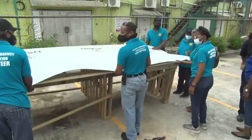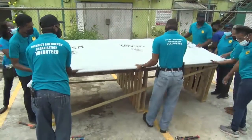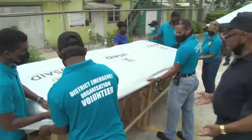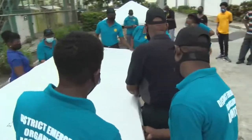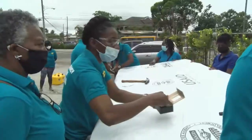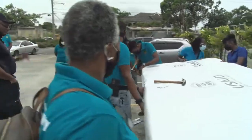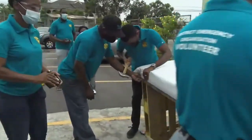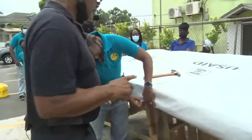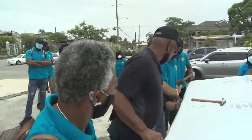What you will find out in the field is that the wind is blowing. Let this edge come down a minimum of two to three inches from the edge of the roof. Don't drive the nails right in at the very edge. Always remember — nailing should happen on one side first and come down.